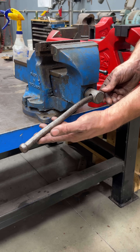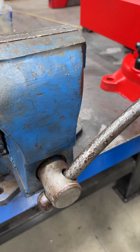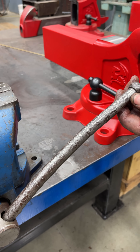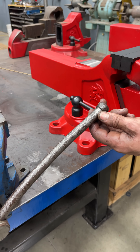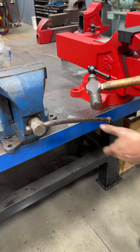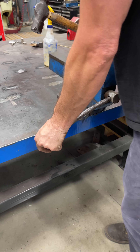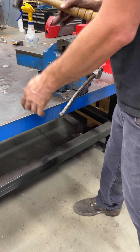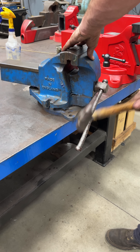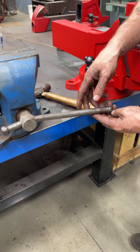In this case, this number six has seen some better days. Look at all the hammer marks on it — this stems from not being able to get enough force. As you tighten the handle, this is what happens. All these hammer marks are from doing this, because this vise is not producing enough clamping force. And once you hammer it tight, you can't get it loose.